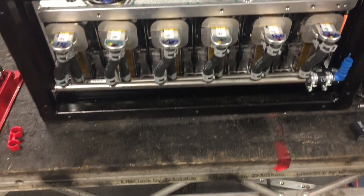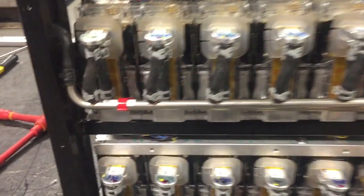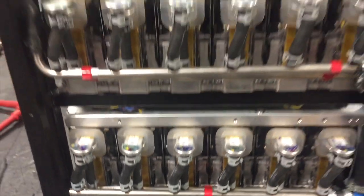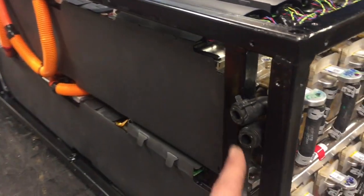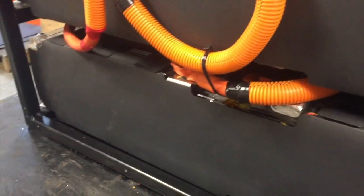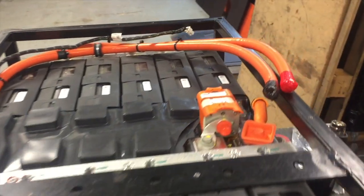So now we're going to check the next stack of modules on and carry on with the same process. It's quite tight in a couple of places but all in all I couldn't have asked for a better fit. And then we have the outlets here so we just need to get some adapters then panel-mount them to the sides. All the high voltage connections are done under here, so that's our negative which then loops around and goes up to the positive on this side.